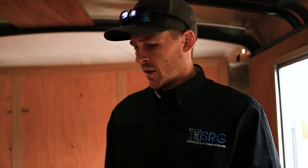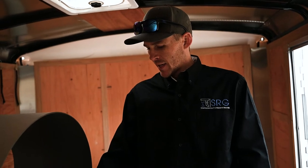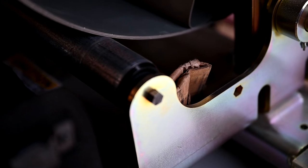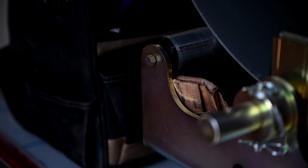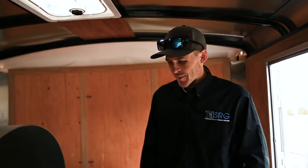We switch colors a lot, so the coil cradle makes it really quick to just throw another coil on at the next job — it's a cheaper option too. One thing about these mini coil cradles is they don't have a coil brake, which can cause problems. I just use a chunk of cardboard shoved in between the frame and the roller — it slows the roller right down. You throw a new chunk of cardboard in every once in a while. Pretty simple solution.